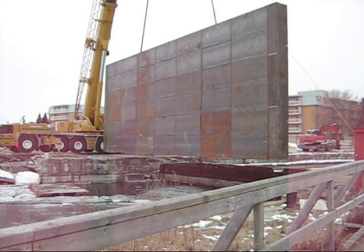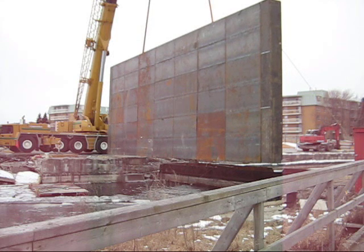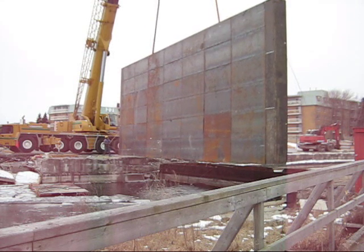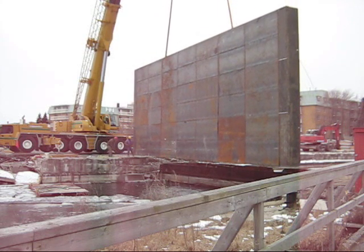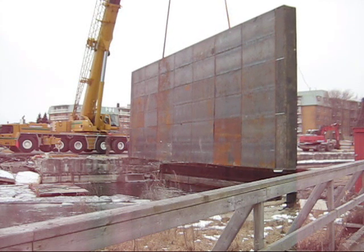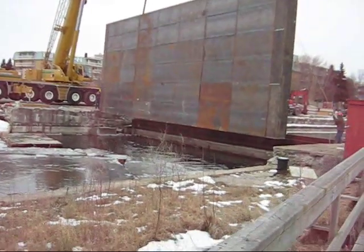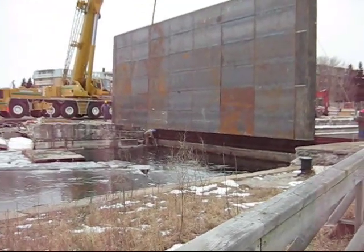And how long did it take to figure out what it is you're going to do? It just took a couple of afternoons and a sleepless night to know the sense of what we're going to do. Hatch Associates had a schematic drawing of what they thought would happen. And we have to do various things, like we have some drain holes in the members, because when the thing is vertical, we don't want it to hold water in the trough of the beams. And we don't have any hollow members, because if we did, we could have water inside them, which is eventually going to freeze-thaw and could burst the members. So everything is open to the air.